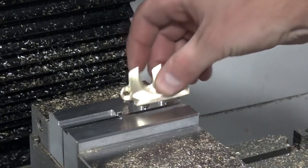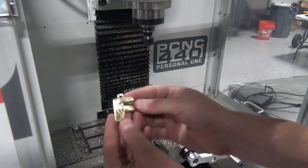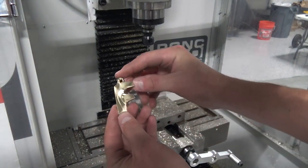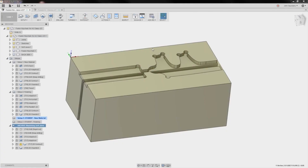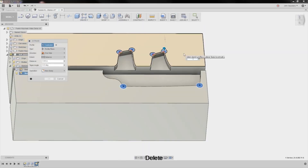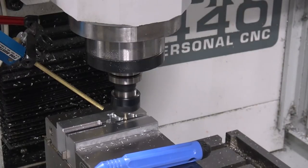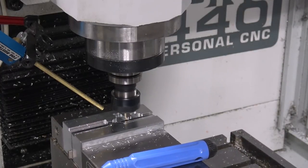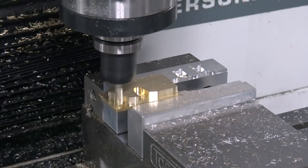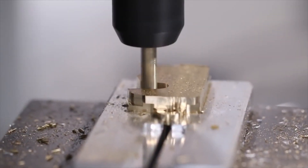Starting off with a Fusion F. Here we have a relatively simple part — it's a keychain in the Autodesk Fusion 360 letter F. In this video, we walk through the CAD side of designing the SoftJaws, moving into the CAM workspace to machine the SoftJaws, including relief so that we don't over-constrain, nor make it too difficult to machine the SoftJaws. And then finally, we show the actual machining of both Op1 and Op2 to get these done in one operation.